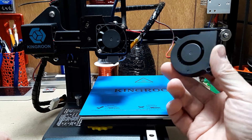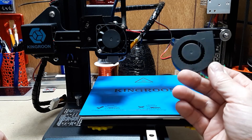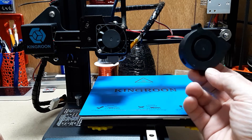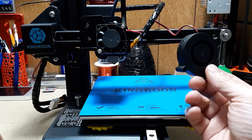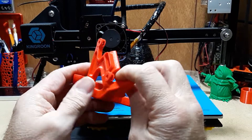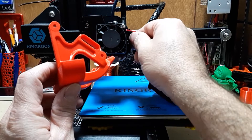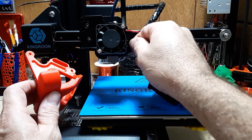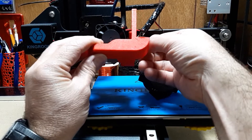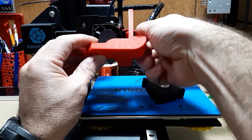You're also going to need the new parts cooling fan — this is a 50x15mm, 24 volts. There are a bunch of these on Amazon; take your pick, read the reviews, do your due diligence. Some have better reviews than others — I've used some that have lasted months and others that only last a couple of weeks, so just go through the reviews and see what's working right now. Next, you're going to need your fangs for your new shroud. You're going to put one M3 nut in here, one in there, one M3 nut in this side of the hot end shroud, and one M3 nut down here. Pop the new shroud on — the screw goes in from the side.